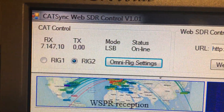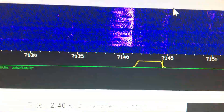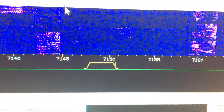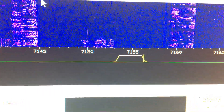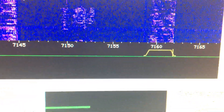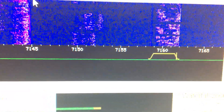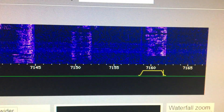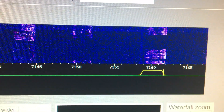The radio was on the 40 meter band, and you can see it's nicely tuning here. The steps are a little coarse because the poll rate is 500 milliseconds, so frequency is only updated twice a second. It's better to set it to around 100 or 200 milliseconds for smoother tuning. And that's basically it.